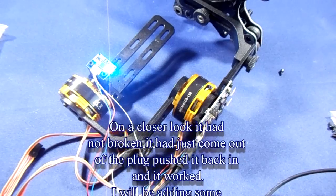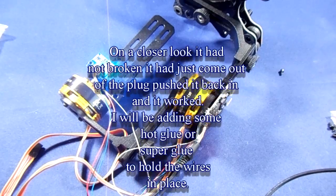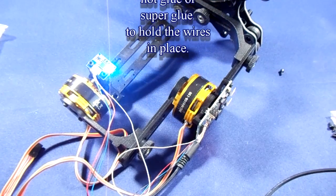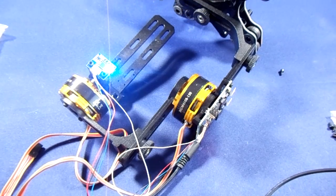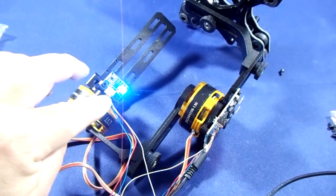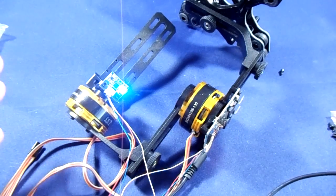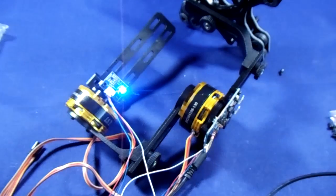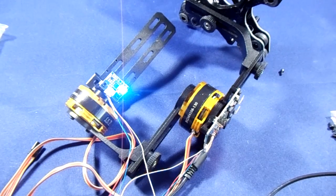An update on the white wire that seemed to have come out — it doesn't seem to be crimped correctly or properly. Be aware that this could be an issue; I will bring it up with DYS. I basically just poked the wire back in the hole and it started working again, as you can see. I would personally definitely put some hot glue on the end of those connectors just to make sure they are going to hold. Because the wires are so stiff, it needs a softer silicone wire. I would definitely put some hot glue or super glue on there to aid keeping the wires in place in the plug.